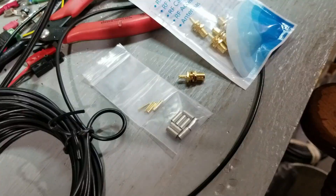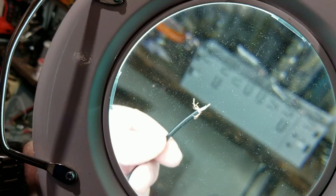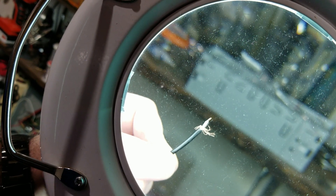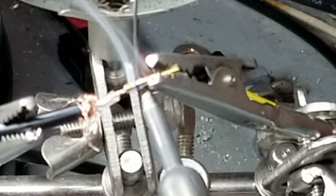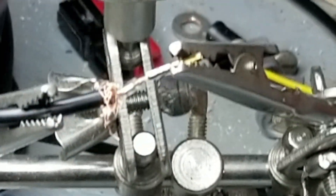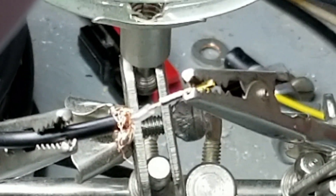We've laid out the SMA connector that we're going to use, and AC4DM is helping with the solder job. We've got the shielding pulled back and exposed the copper tip, which you can see under the magnifying glass — pretty close to what we need. We're putting some solder in the small little hole which will ultimately anchor the tip onto the connector. When you remove the solder and iron it will wick down inside. We'll let it cool — we now have a tip on the end which will be part of the SMA connector.